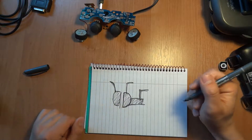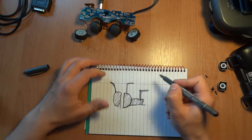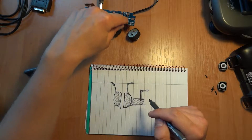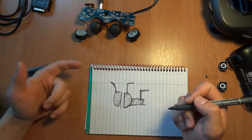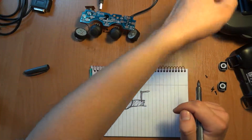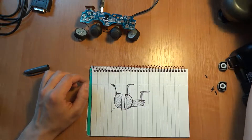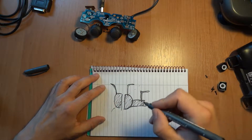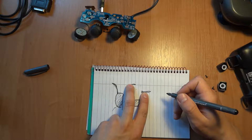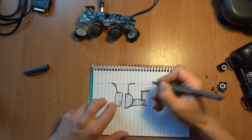The button connected those two halves. There was a connection trace over here, a connection trace over here, and also a connection trace over here. When cutting I broke the board somewhere because I had a direct connection to the test pin, so I thought I'd just break it and make it a smaller board. But this was weird - you'd expect both ends to be exactly the same thing, but this was the button connection.